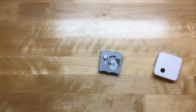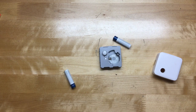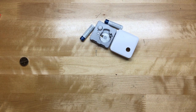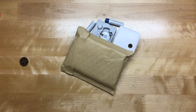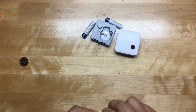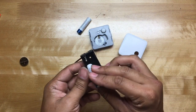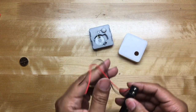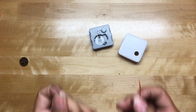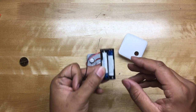Yeah, these are cheap batteries, but the original Panasonic that came with this motion sensor didn't really do that much better. So I got a little hack: how about we get rid of the 2450s and just put regular triple-A batteries into this thing? You can get the adapter off Amazon. Basically it's a triple-A compartment — you put your triple-A batteries in here, solder the negative and positive wires on, and you've now converted a CR2450 device to accept triple-A batteries.